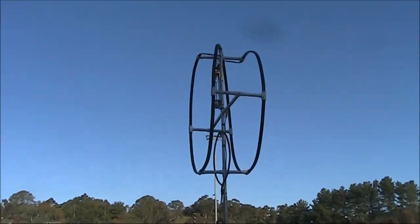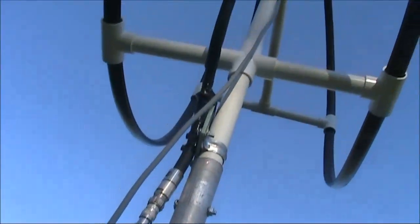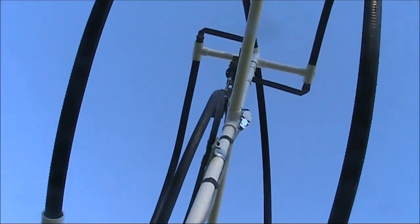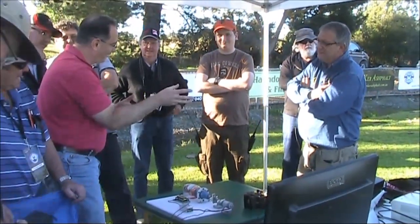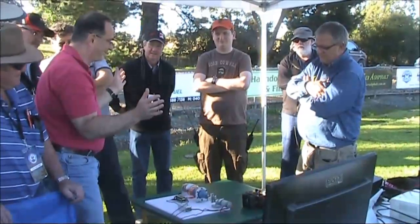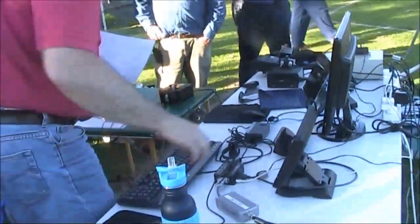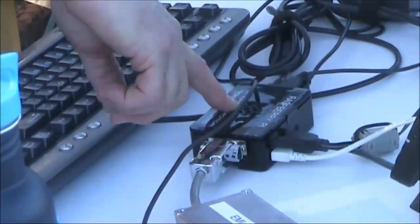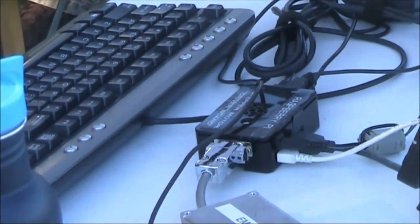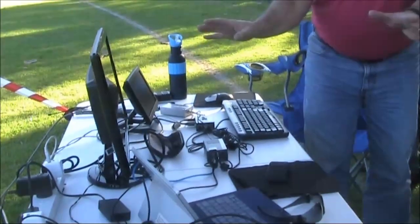That's coming through a 14 to 1 reduction gearbox, which takes you down to 0.13 degrees per step. And you need that granularity when you're playing around with that. I developed some software in conjunction with a young man. That's the simplest form, and the really big negative with this system is that the moment you go off frequency to another frequency, the antenna goes straight out of resonance, you don't hear them anymore, and your VSWR is infinite. Then, moving a little bit further along here, this is a Raspberry Pi in this little box, and also the stepper motor driver board, which converts what my software tells it to drive that stepper motor onto that antenna out there. So everything is interoperable.